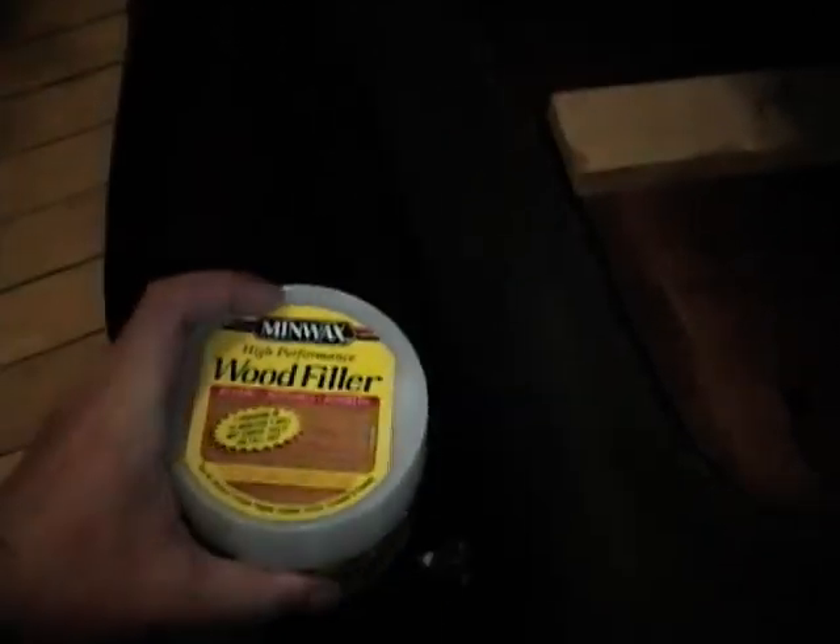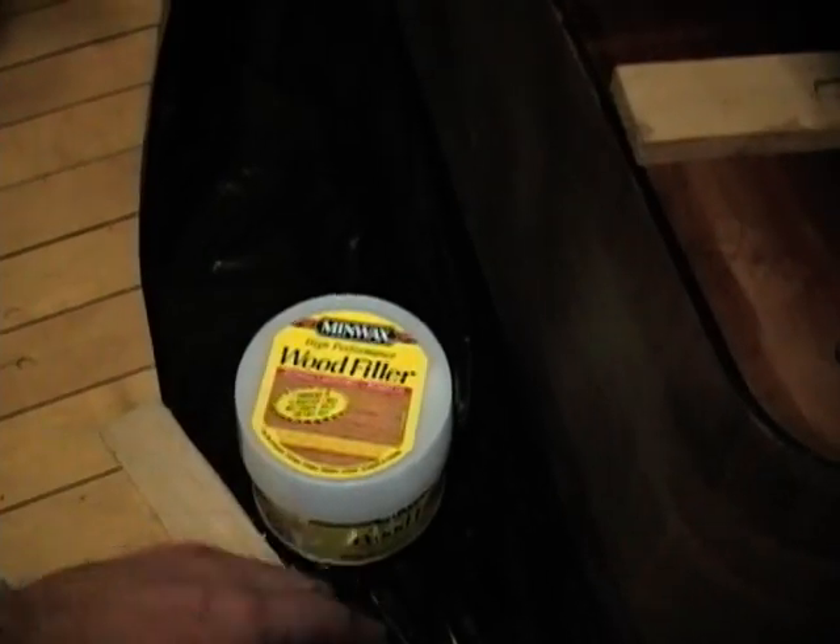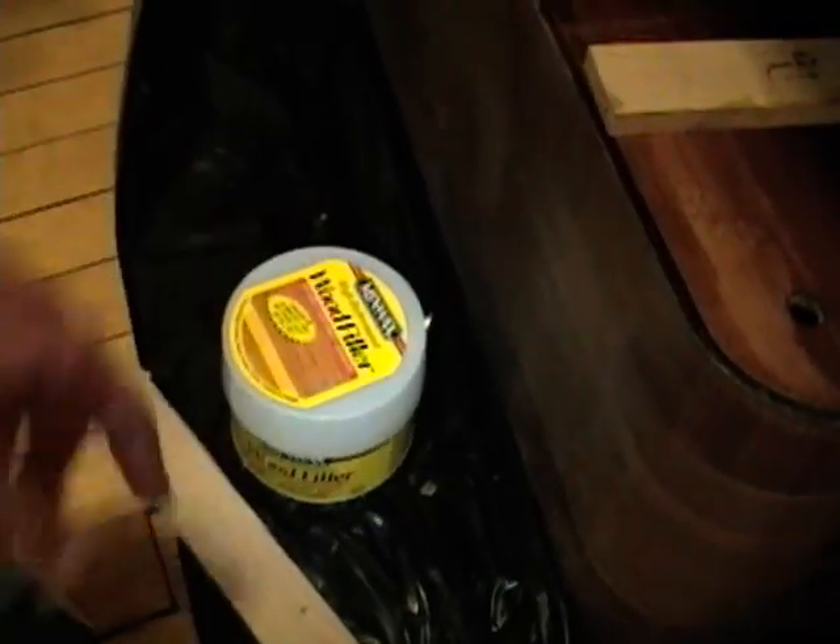The main compound is in this big can, but underneath this lid there's a little bottle of hardener. You squirt a little bit of the hardener into the putty-like material and mix it up. Then you smear it in and wait for it to dry. Now once that's done, I need to put some new veneer on it. I've got a couple of matched sheets of walnut. I'll take one and flip the other over and find a section that looks kind of interesting, and I'll put that on here with the seam right down the middle.